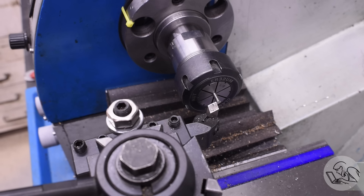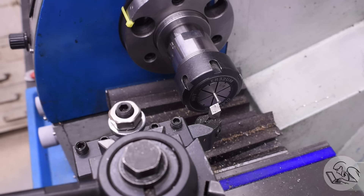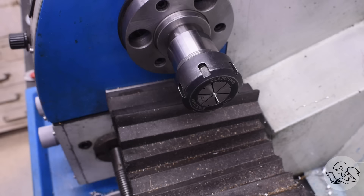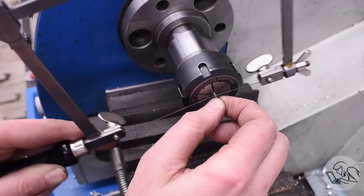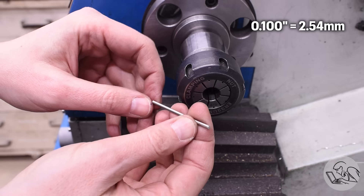Those holes are for pins, so now I need to make them. I have stainless bar stock that fits in a collet on my lathe, so I'm going to turn those pins. These are very small — 51 thousandths diameter. The trick to turning diameters that small is to do it all in one cut, because on the first cut you have the rigidity provided by the full diameter of the stock. If you try to do it in two or more passes, there's no rigidity left and you can't make successful cuts. 51 thou is probably below the minimum rigidity limit on 304 stainless, but if you nail it in one that's a perfect pin. I'm not going to bother parting that off — I'll just use the fret saw. These pins might be the smallest pieces in the entire locomotive so far.